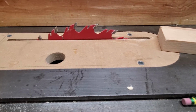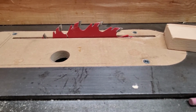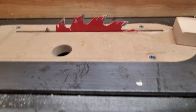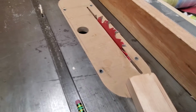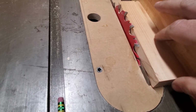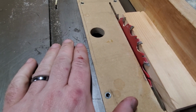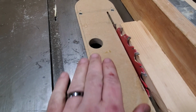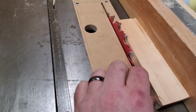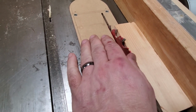And I'll mention, this is only the second real through-cut kickback I've ever had in my life. And the first one did send me to the emergency room. I was pushing a piece through using two hands. So I had a piece pushing here. It was wide enough. I had another piece pushing here because it was a little bit of a wide board. And when the kickback happened, the hand I was using to put pressure against the fence, which you do sometimes, thought I was far enough away, sent my thumb across the top.